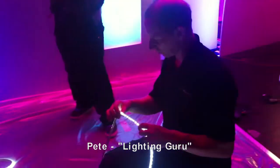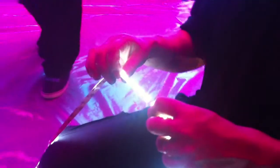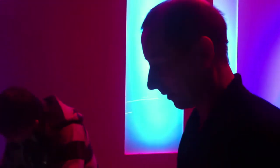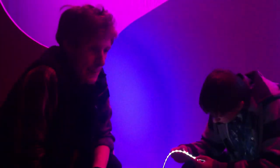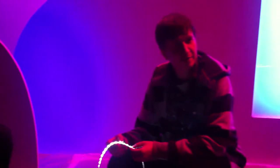The actual ribbon itself, they use that for single colour or tricolour, right? By putting different LED inserts on them. Right. So they can put a red, green, blue one on, or they put one on that's just white, just red, and then they just join them together. Very clever, isn't it? So theoretically, you can just keep wiring them end to end.